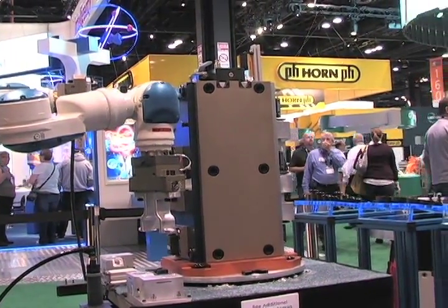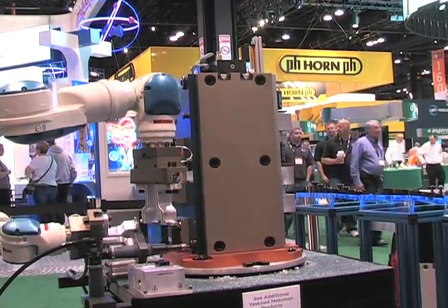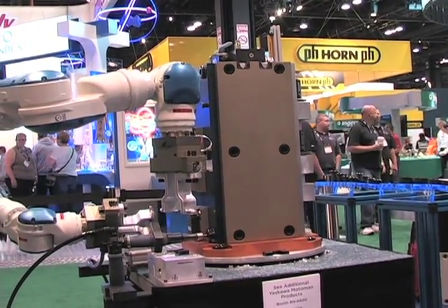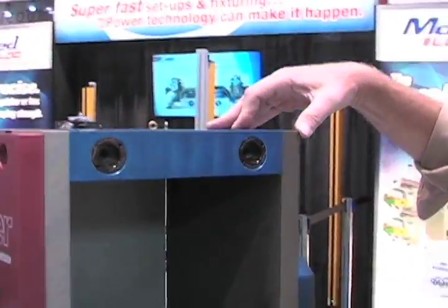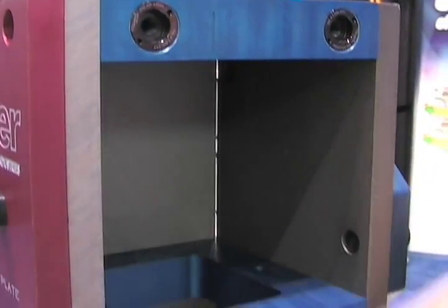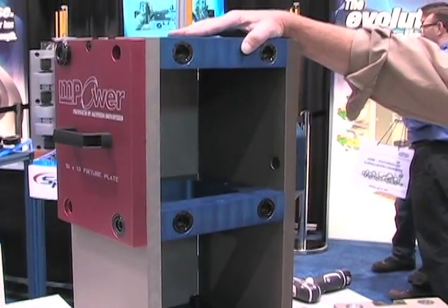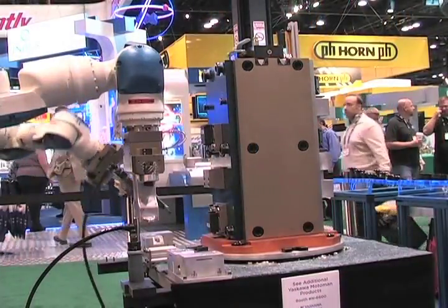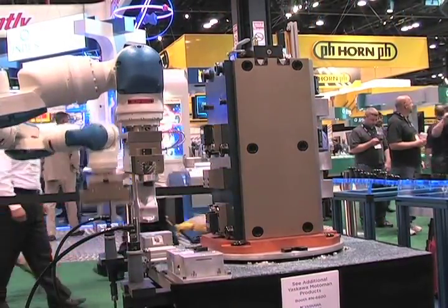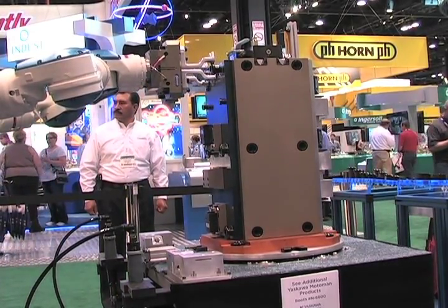What's also nice about the Speedlock is that a variety of fixturing methods, whether hydraulic or pneumatic, can also be used within the system. The Modlock tombstone has all the hydraulic, pneumatic, or magnetic connections internal within the tombstone. It's a hollow tombstone technology supported with an exoskeleton — the fixture plates are what give it the strength. So we can reduce the overall weight on the machine by using this type of structure.